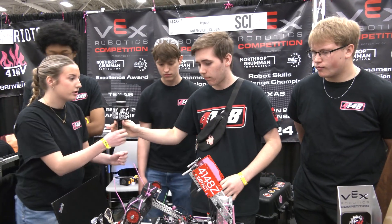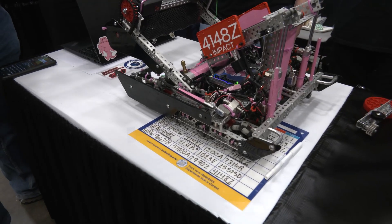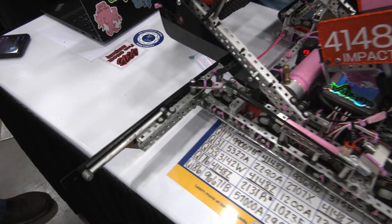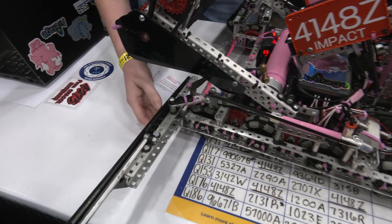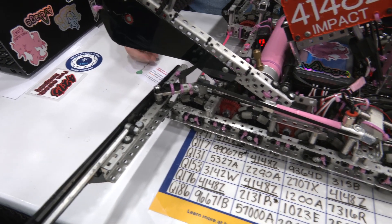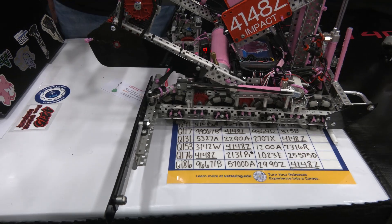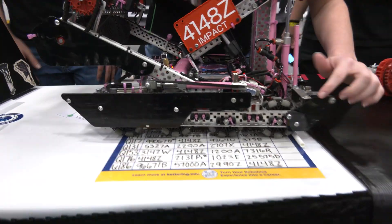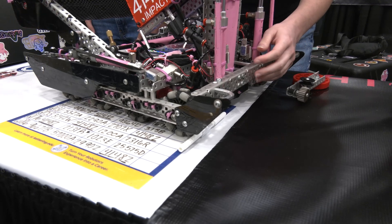Hannah, talk about your wings and your strategy for utilizing them. We have locking wings powered by a single-acting pneumatic piston. We chose locking wings so that whenever there's any give, they won't retract. We use them for both defensive and offensive strategy — defensively to push tri-balls and other robots to help acquire tri-balls, and offensively to push them into the goal faster and more efficiently. We used to have slits to help get over the bar, but that got caught on the wall. Now we have a 45-degree polycarb cutout with three points for durability, which helps us get over the barrier much more efficiently.